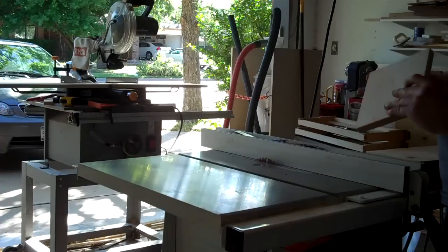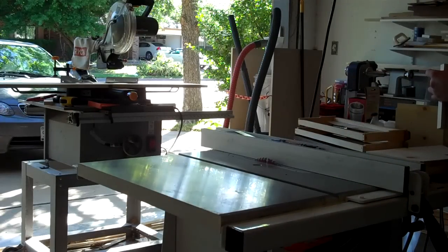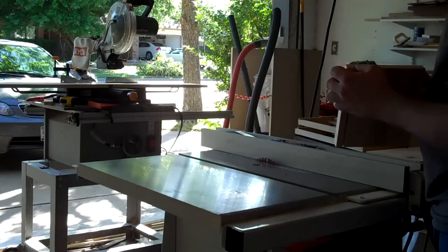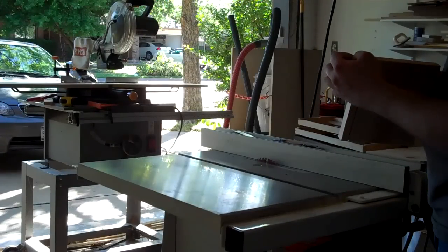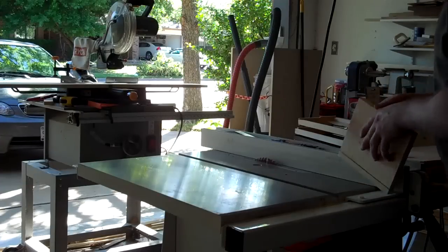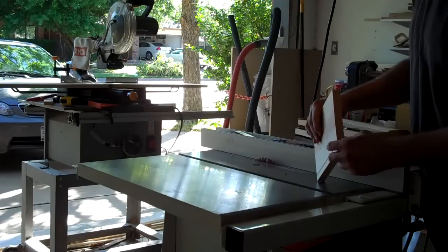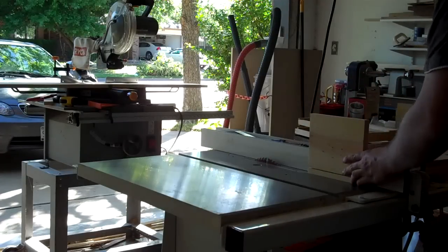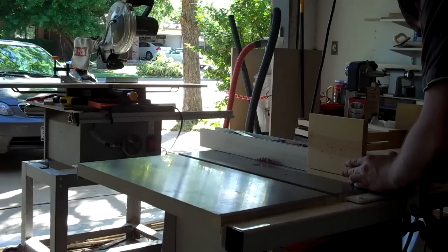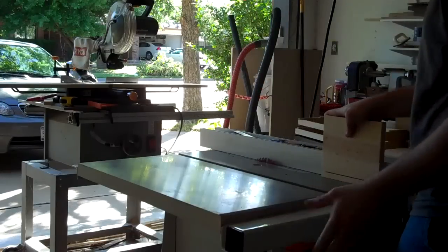And then I've got to cut this excess off. I believe that needs to be 3/8 of an inch. So yeah, you want 3/8 of an inch left over on the side. So you got to figure on your table saw with the width of your blade, got to figure out what that is. Now I'm going to actually be running these like this with the piece that I want to keep against the board, so the other piece doesn't go shooting off on them. So I can actually set this to 3/8 of an inch, and then run these pieces. Just gonna double check, make sure that's about where I want it. And that is.